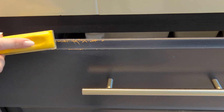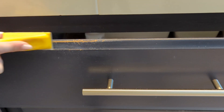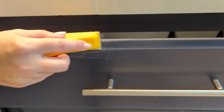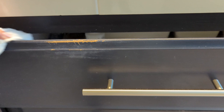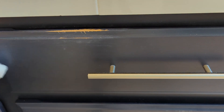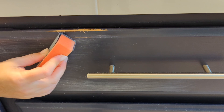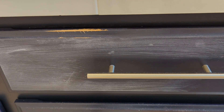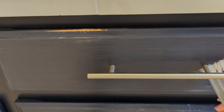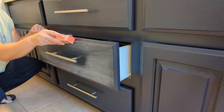This is going to work. I'm ready to work on the problem spots on the front of the vanity. Starting with the worst offender — this spot on the top of the drawer that has been used to pull it open — I'm just sanding that smooth first. Then I'm going to sand over the whole drawer front so it will take the polycrylic. I didn't worry about removing drawers or doors from their positions, and I didn't worry about taking off any hardware. Just like before, brush away all the dust, even using a little brush to get right in by the hardware.